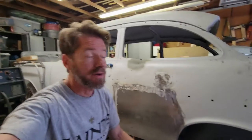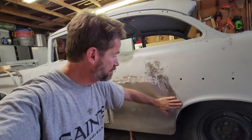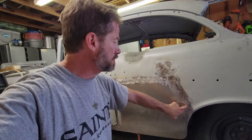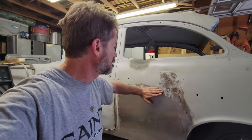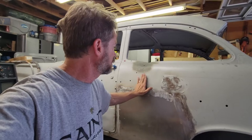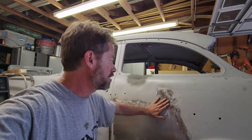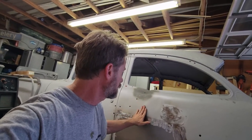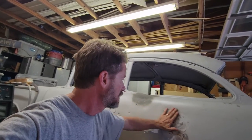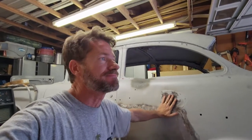A lot of work. All right, this is about all I can give it. It's in great shape, came out really well. I'm pleased with it. I got a little bit of an indentation over here I'm not happy with. And then as I was doing this, even though I was welding down here, suddenly there's a couple of kinks or warps up in here and they just started oil canning, and I was trying to control my heat, but I know I probably got a little too hot and I'm gonna have to do some heat shrinking up in this area to get this straightened out. There's a dip here and suddenly there's a bulge here and there's a dip here, so it's kind of like Surf City USA right now. But yeah, I'm gonna have to figure out how to do that. I've never successfully shrunk metal before, but I'm sure I can do it.